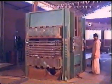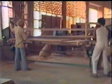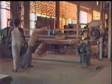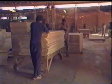The assembly of glued veneers and solid frame is then pressed in a hot press under controlled temperature and pressure for setting of the glue. Flush door shutters coming out of a hot press are cut to the required sizes. As its surface is a bit rough, it is made smooth by sanding. Lastly, the boards are checked and tested for any defects.